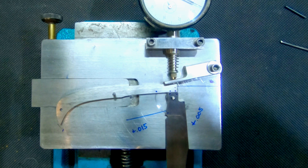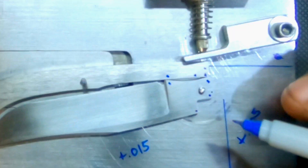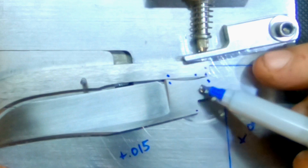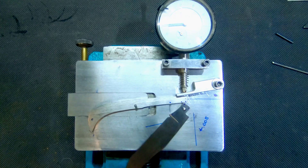On the closed position, it's essentially the same thing. I can take a little off of here and a little off of there, but I have to keep that radius going so I only have two points of contact with that radius. If I want the tip to sit a little lower, I'll take it off of here; if I want it to sit a little higher, I'll take a little more off maintaining that radius. I'm sitting at .13 so I can deal with that — I don't have a whole lot of adjustment left to make. That's the essential relationships between them.